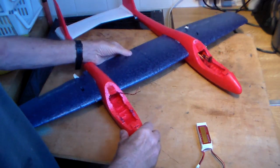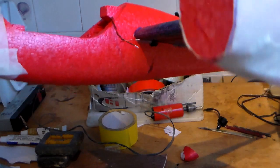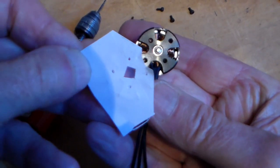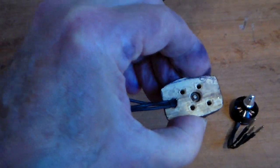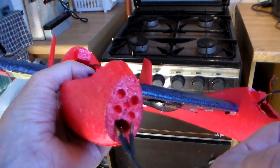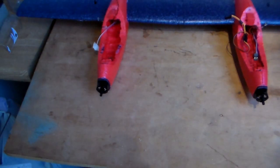The motors arrived — a pair of BR-1806s, clockwise and counterclockwise. The first job was to very carefully mark up the nose sections with a little bit of down thrust, trying to get them in the same plane to mount the motors. Next job was to make a little template and then make two mounts — these are actually a laminate of plastic on some wood. A little test fit: make sure you leave the hole clear in the middle for the spindle to spin and the tiny little circlip. I made a hole for the wire to go through to the cockpit area, plus some little recesses for the screws. Next job was to hot glue them on, being very careful not to get glue onto the screw holes or where the circlip spins in the middle. I'm pretty satisfied I got them in the same plane.